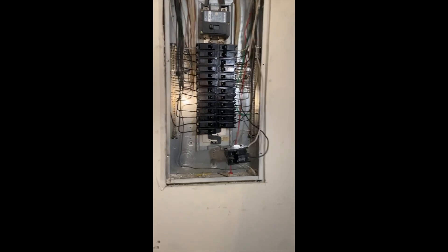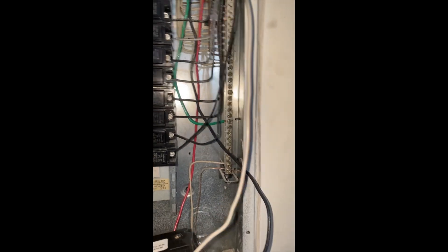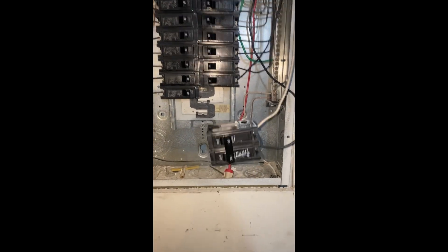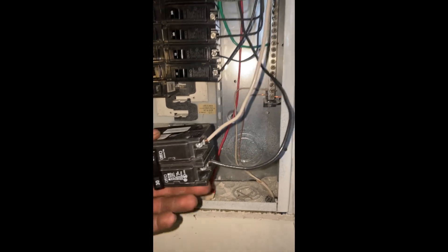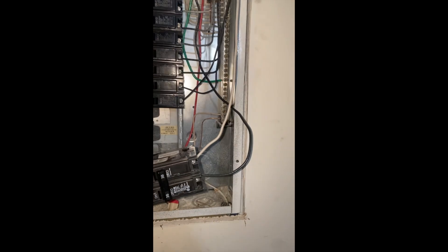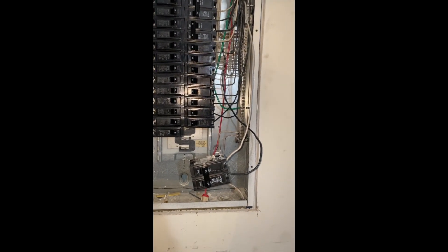I'm down at the panel. I disconnected that white wire from the ground bar — I'm not an electrician, I just know how to do this stuff. I got the old 30-amp breaker out of the way so I don't want these wires flopping around and arcing off something while I'm working upstairs. I got the new breaker in but I'm not going to hook it up to the panel yet — just leaving it disconnected. Black goes to the bottom, white to the top, green on the ground, and red is capped off. We're going to go upstairs, install the receptacle, get everything buttoned up, and then we'll put in this breaker and test the circuit.